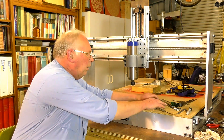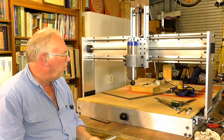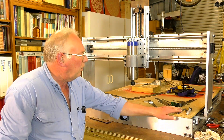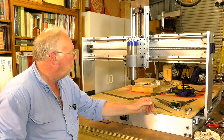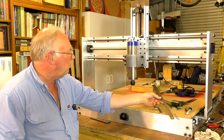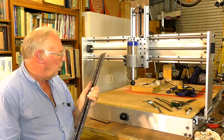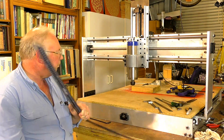Sort of measuring equipment - it's good to invest in one of these. This is a digital vernier caliper - I find these easier to read, especially at my age. And a precision little engineer's rule, a 12-inch or 300 millimetre rule, and a square. I've got a couple of different squares I use. You can do a lot with this, like line the gantry up.